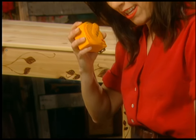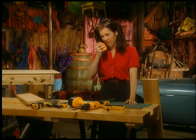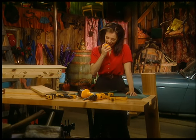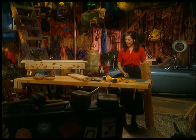The apron is two 46-inch boards and two 23-inch boards. The decking is five 52-inch boards, and the legs are four 34-inch 2x4 boards. Recorded — got that? Is that cool or what? Okay, cut some more boards, then we're ready to assemble the apron.